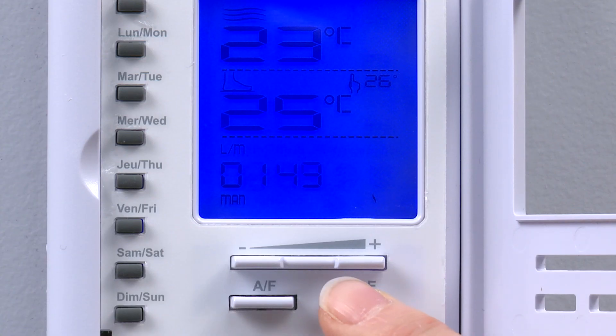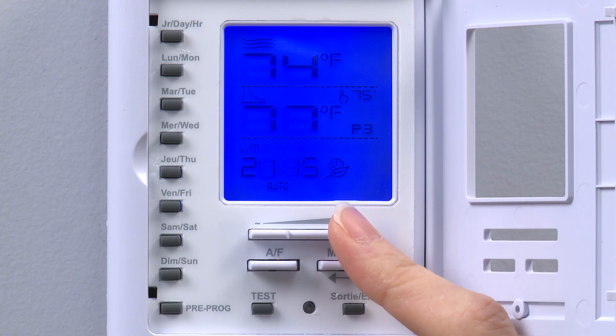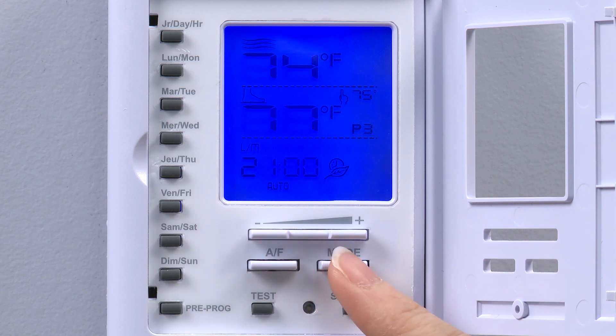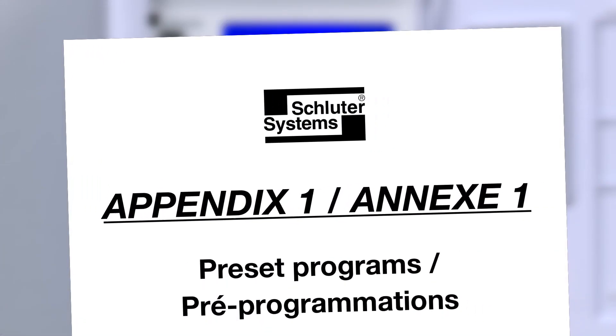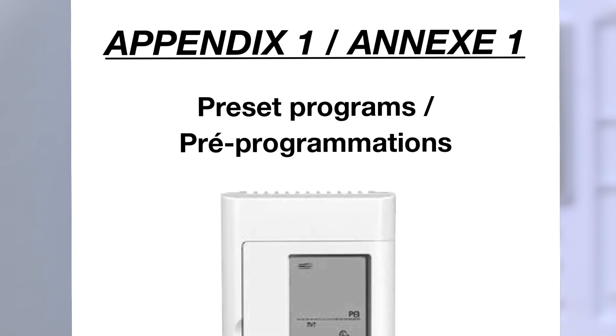Please note that it can take some time for the floor temperature to reach the set point. You can account for this by setting the start of the warming period earlier — for example, 30 minutes before your morning wake-up time — or by using the anticipated start function on the thermostat. For more information, please see the product user's guide. In addition to programming the thermostat manually as demonstrated, you also have the option to access one of over 250 preset programs. Please refer to your user's guide for instructions and the list of preset programs.